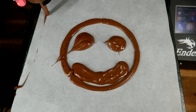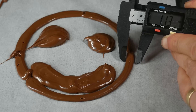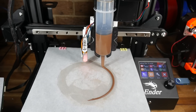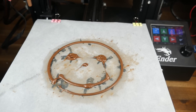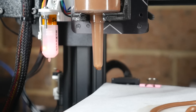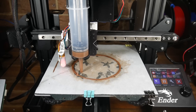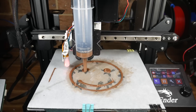Delicious. Now I know that it looks bloated and horrible, but the actual extruder design I'd come up with had worked first go — so now all I had to do was dial it in. I started by measuring my line width and trying to use that to calculate a smaller E-step value, but that wasn't particularly effective. In fact, halving it produced the same over-extrusion. I had to reduce it all the way from 93 steps to only 5, and that finally gave me a smiley face that kind of matched the preview. Next up: tuning retraction. Retraction is actually excellent on the syringe, because as you wind it back the other way, it can literally suck the Nutella back inside. With a custom start G-code intro line to purge the extruder and a lot of trial and error with my settings, I finally got a face with pretty clean separation between the various parts, fairly accurate line widths on the extrusions, and no errant G-code getting Nutella all over my 3D printer.